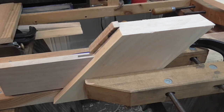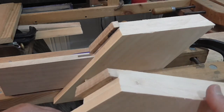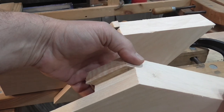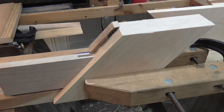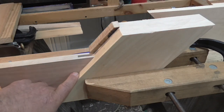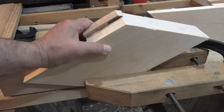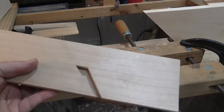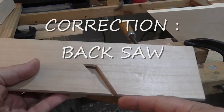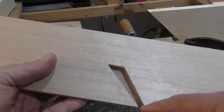Then what I do is I switch it for a shorter jig. Set up the same way, same angles, same configuration, same block of wood, only this is about 3/4 inch shorter. So I set it up again. And that allows me to go in altogether probably about 1 1/4 inches. But what happens is, after I do that and I make this cut, I use a hacksaw to get this cut right here, and then this cut. And I clean all this out with chisels and everything.